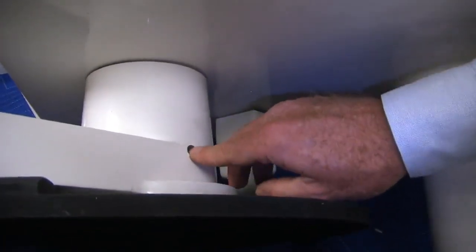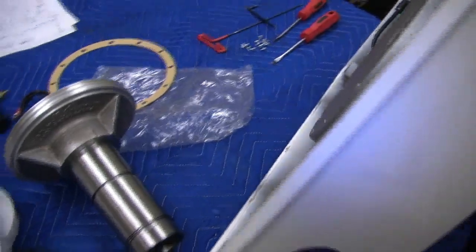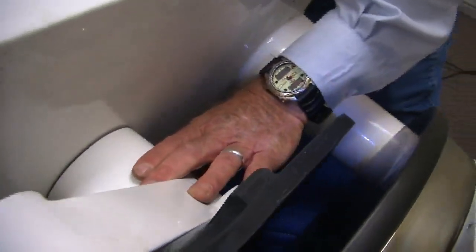There's two set screws here and two set screws down here. Again, one set screw is locking, one is jamming against this slot here. And you have to remove the one set screw and take out this one below it on each side to free that. A lot of people got confused with that in the field. So you have to free that whole cylinder from this top part that's holding it together. Does that make sense, guys? Yes, sir. Okay.